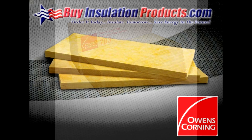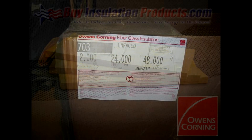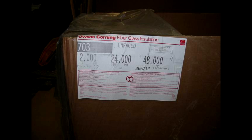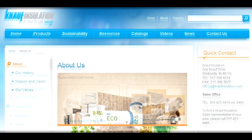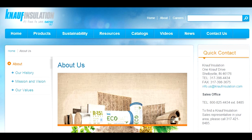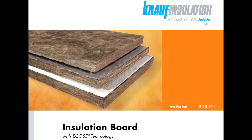The 703 board comes in sheets that are 2 feet by 4 feet, and the thickness can be anywhere from 1 inch to 4 inches. I have used Owens Corning for years, but recently I found an alternate product made by a company called Knauf that has better absorption specifications and it's cheaper. It also has less chemical emissions in the indoor air — in other words, you don't have to worry about breathing problems in your studio when you install this stuff.